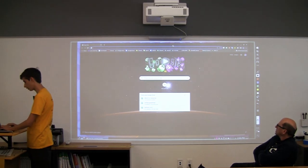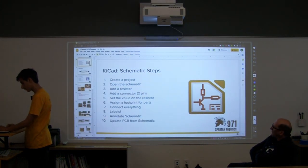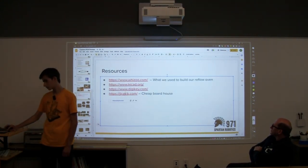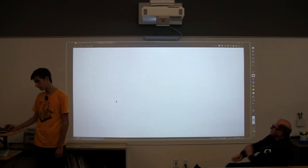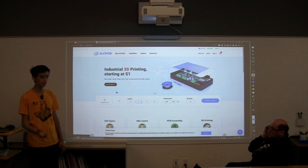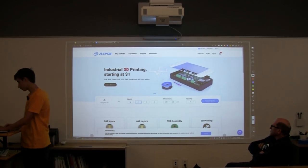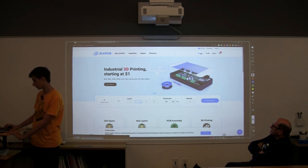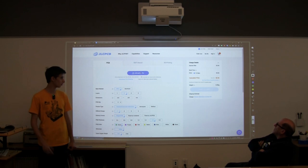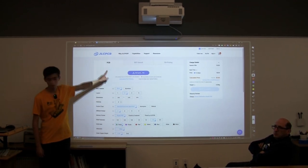We can go to Google Chrome, and, actually, I'll go back to the slideshow. Who we use for our board manufacturing is these guys called JLC PCB. They're pretty cheap, and every time we've bought a board from them, it's worked. This is what it looks like when you're ordering. So remember the files we just generated? We generated the Gerber files, which is what these guys take.